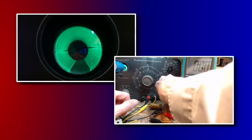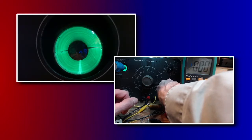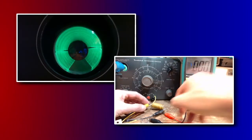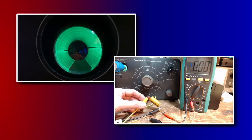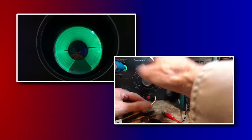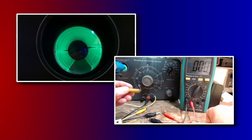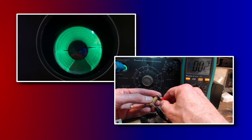Okay, 25 volt leak test. Here we go. Look at that. Even at 25 volts, this thing is leaking. 25 volts. No use testing it any higher. So this is a real bad capacitor. Although this instrument's very sensitive for leakage. It's not telling us how many microamps it's reading, but it's down in that range. I think I read somewhere that some people think it's a little too sensitive.